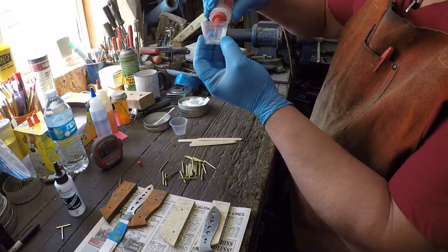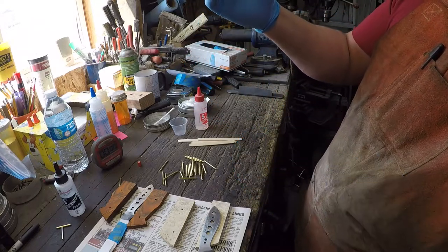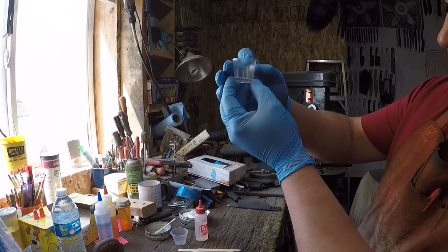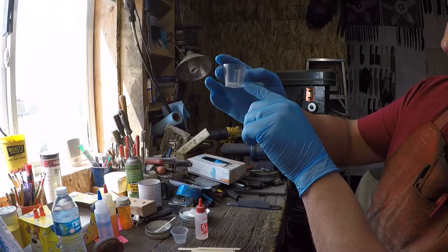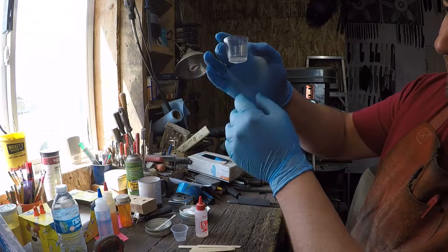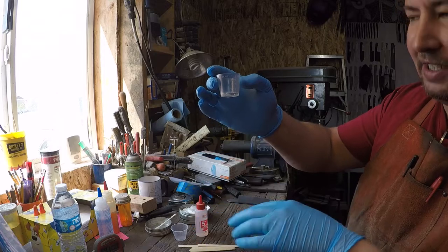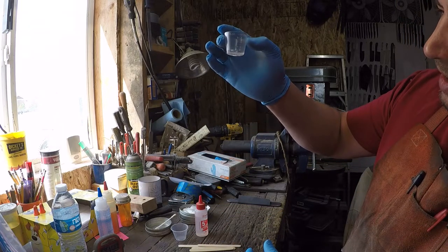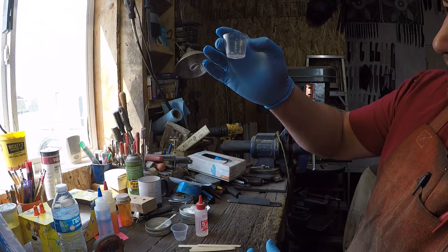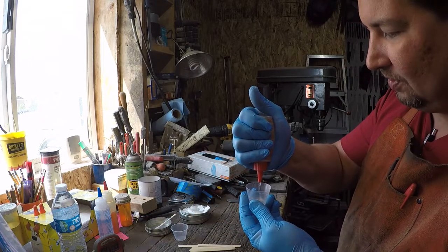And this stuff is, like I said, kind of cold, about 50 degrees. So that's going to make it kind of a pain in the butt because it doesn't want to flow as fast. You could see that I poured some in there, and then we got to wait and let it settle because it's peaking inside there. Peaking as in mounding up, and then it's got to take a little while for it to settle back down on itself. Okay, that's going to be like 5/8 of the way to the line, so we'll mix a little bit more in there.